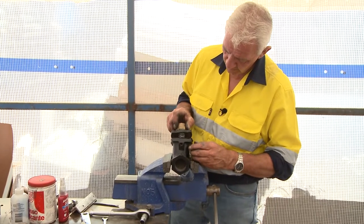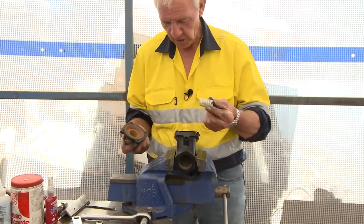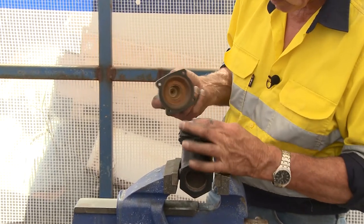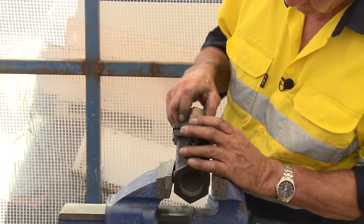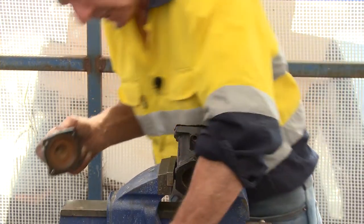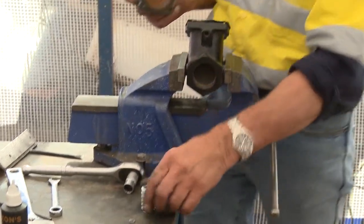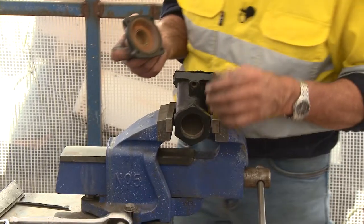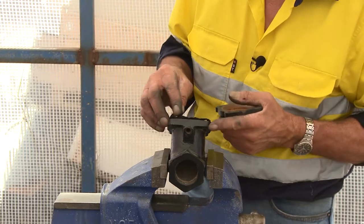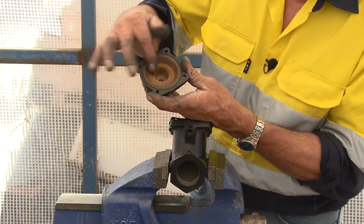We've got that big brass spring - and there's the spring. The spring fits up inside that big brass nut, so now you can see what I'm talking about. If you leave that housing on there you are fighting that big nut to try and compress that spring, and there's quite a substantial amount of recoil force on that. There's the top. Are there any gaskets? No, because the diaphragm is the gasket.